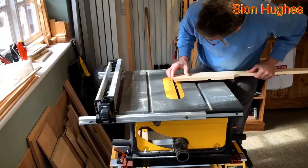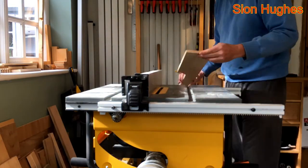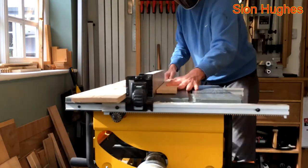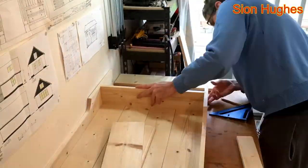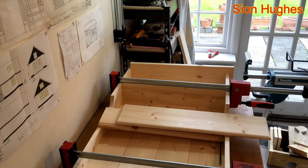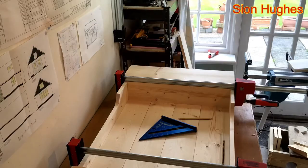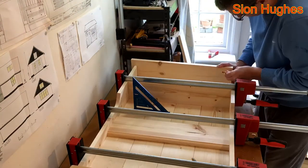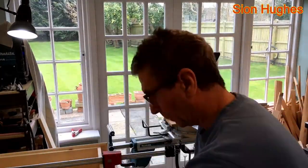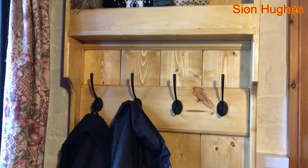It's back to the table saw, nibbling away enough to sink in that very top piece of timber. At the same time I take the sideboards and by taking a cut and moving the fence over I create rebates for the side so that the back tongue and groove actually melts into the sideboards. Around this stage I finish the whole thing off in one go - off camera I assemble it, glue it, nail-gun it, and make a little frieze. And there we go - that's the finished item in all its glory.